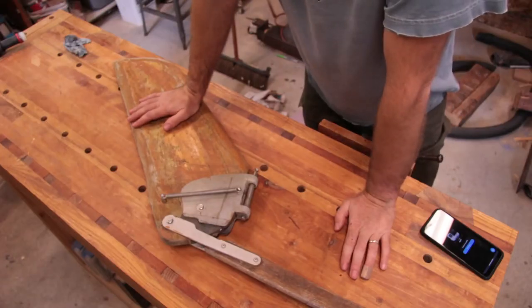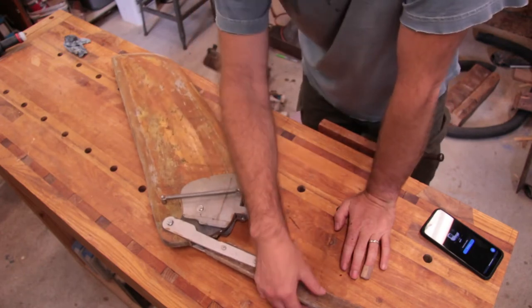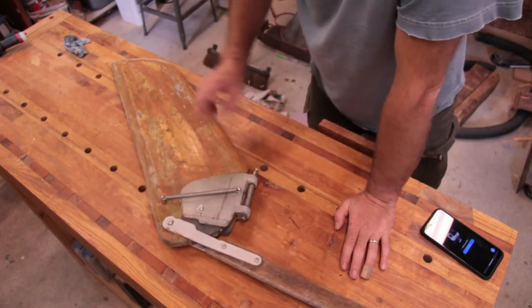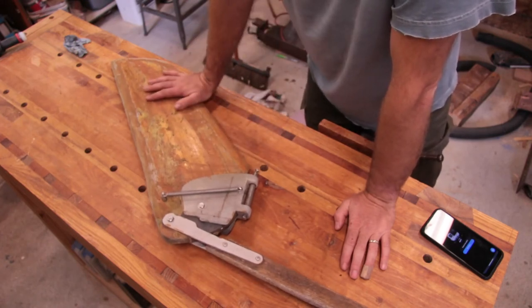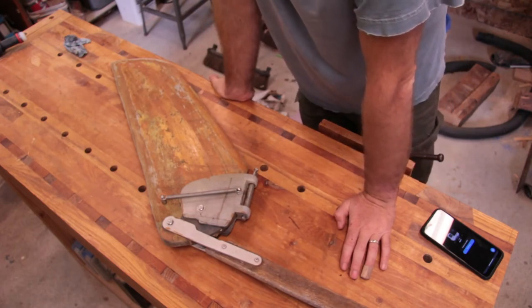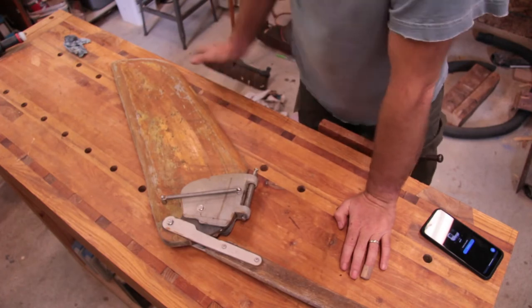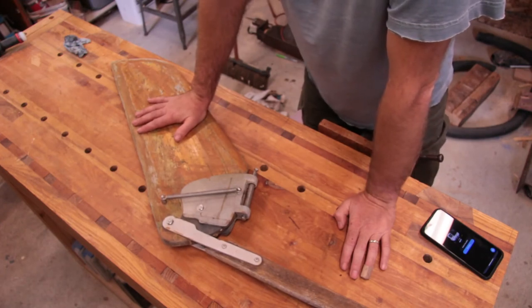This is the tiller rudder assembly for my new Sunfish sailboat. And the wood is in pretty good shape, but the finish is still peeling off and pretty bad. So I'm going to strip off the hardware and refinish it with some spar urethane. I could use it as is, but there's no sense putting unprotected wood in the water, especially since the rest of the boat isn't ready to sail yet. Anyways, I'm going to get this stripped down and start refinishing it.